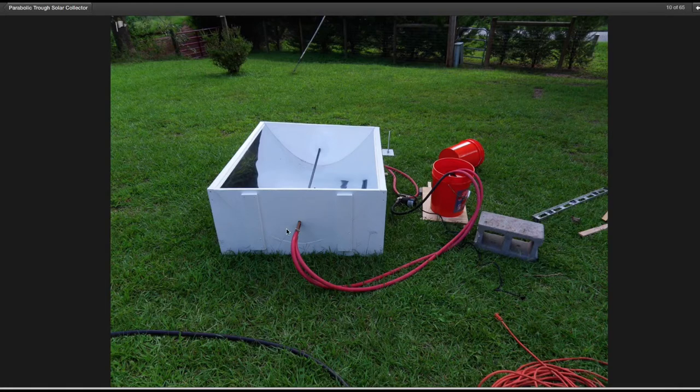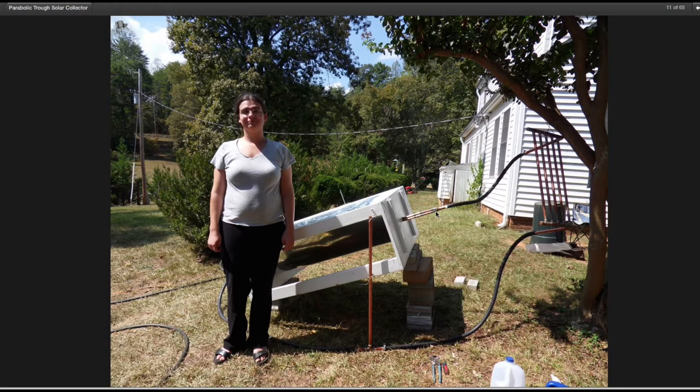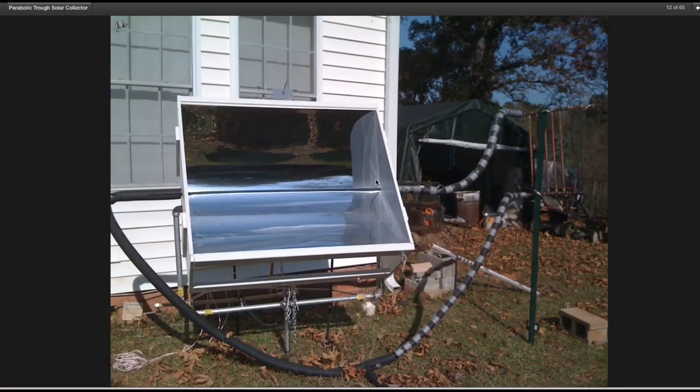This is some experiments I did — just seeing how it would transfer heat. I had a bucket of water with a pump circulating water through it in full sun, just looking at the temperature rise. Then I had another idea: my daughter and I would boil water, make steam, have the steam come into a radiator, condense, come back down — almost like a heat pipe arrangement — taking sunlight to boil water and make steam, letting the vapor condense and so forth. Mounting it in that orientation was going to be difficult, so I ended up mounting it horizontally using galvanized pipe and a tee, drilling holes in the ends of normal pipe fittings.